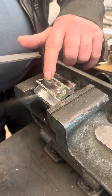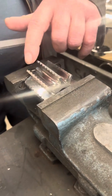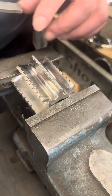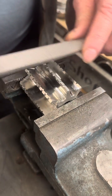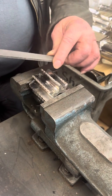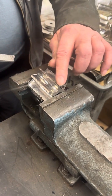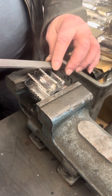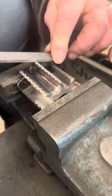What we're trying to do is re-establish the cutting corner on the front of the blade. The cutter is on a helix, so we're going to have to change the angle of the file as we go. If you watch how the file is removing material, you can tell if you're at the correct angle.